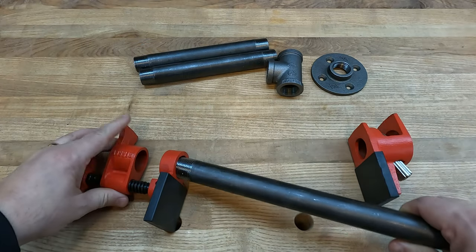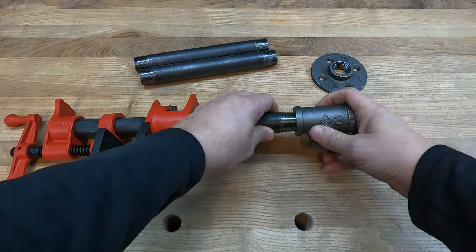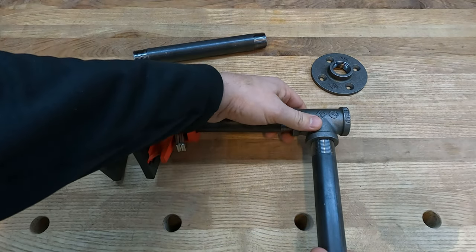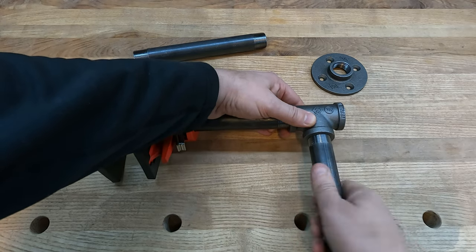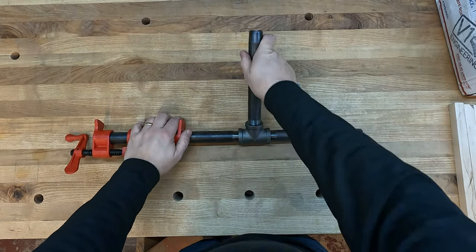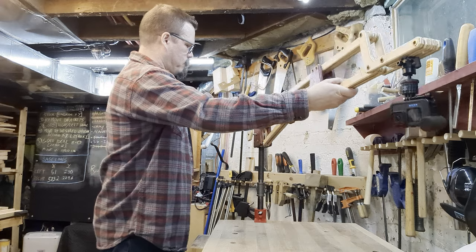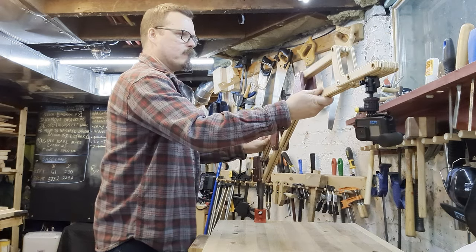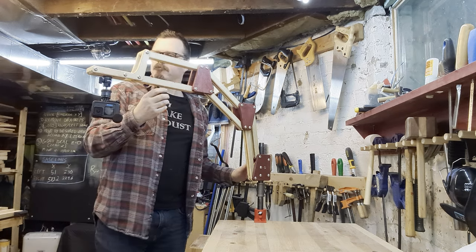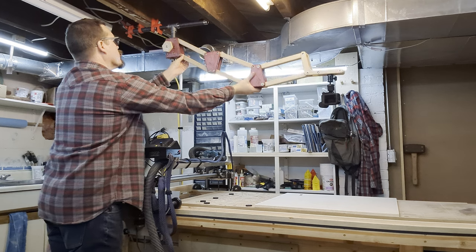But the original goal was to hang the jig from the ceiling joists. So what I'm doing is converting Ben's original pipe clamp design and adding a T-junction in. It uses two extra eight-inch long three-quarter inch pipe, a T-junction, and a circular flange to let the jig rotate before locking it in place with the handle. This lets me use the pipe clamp on a workbench like Ben envisioned, or hang it from the ceiling and get overhead shots in my CNC.